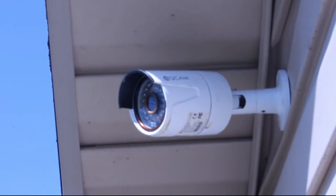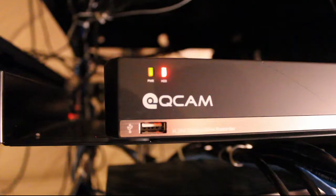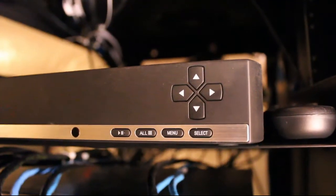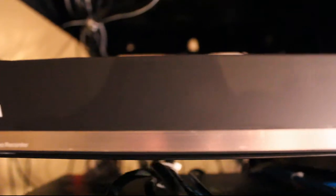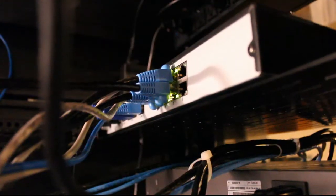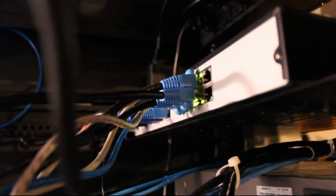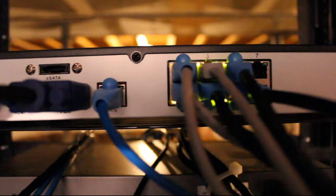The camera I'm adding is a 3 megapixel power over Ethernet camera from QCAM, which also included an 8 channel network video recorder. I'll post links to all equipment and tools in the video description. The NVR has a 2TB hard drive and a built-in 8-port power over Ethernet switch. There is a basic phone app available for live viewing your cameras and it does use some random servers in China for remote viewing, but since I'm using a Pi-hole ad blocker in my network, the NVR is blocked from connecting to those IPs. This means I can only view my cameras when connected to my local network via VPN, but that's a trade-off I'm willing to make for better privacy.